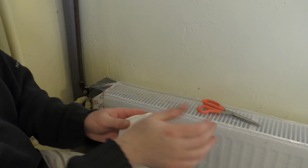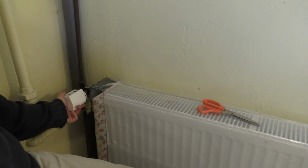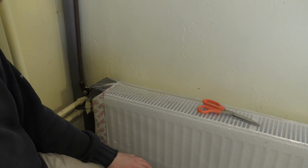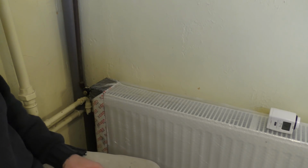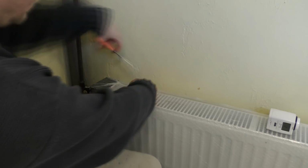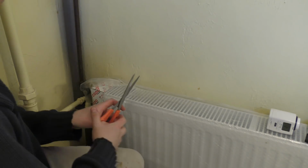Okay, I was trying to put this thermostat back on there, and you mount this black piece over here, which has threads for the thermostat, and you're supposed to turn that in. But it can't go in because of the plastic that is on here. So I really need to remove the plastic of the radiator. I needed to do that anyway, but I was actually planning on waiting just a little bit. So I guess we can take this corner off. Just remove that. One plastic corner out of the way.